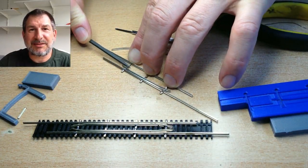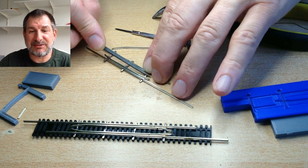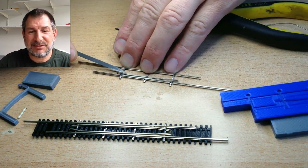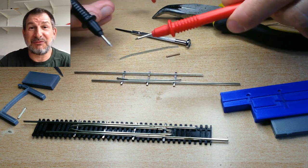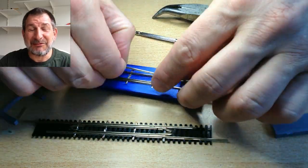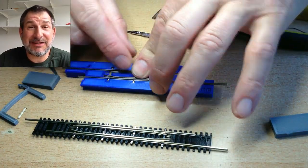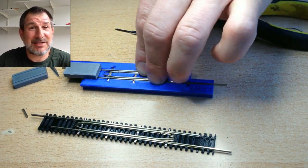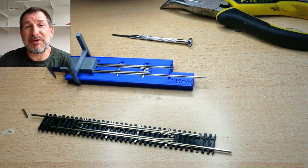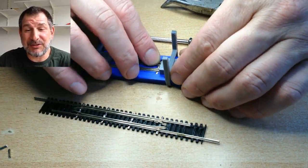I got the manual gaps in and it works, but it was definitely a lot more work. I wanted to make sure there wasn't a short, so I checked it with the continuity setting on my volt meter. If you have the pre-gapped short ties from FastTracks, do not use them for the re-railer itself — you will cause not only structural soldering problems but also a direct short.